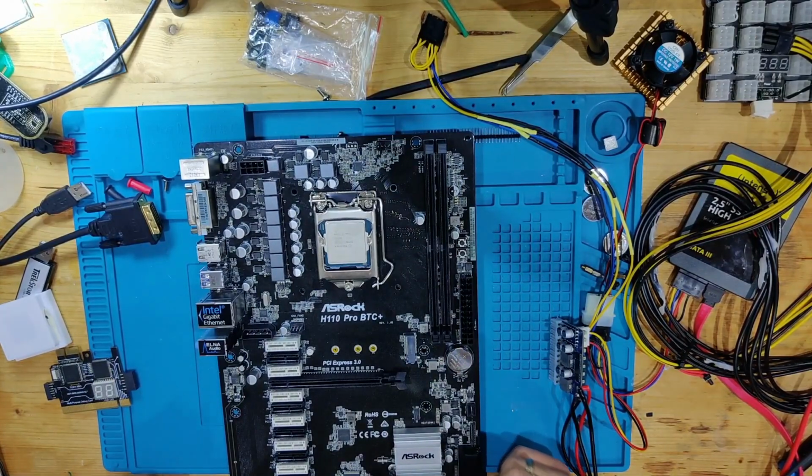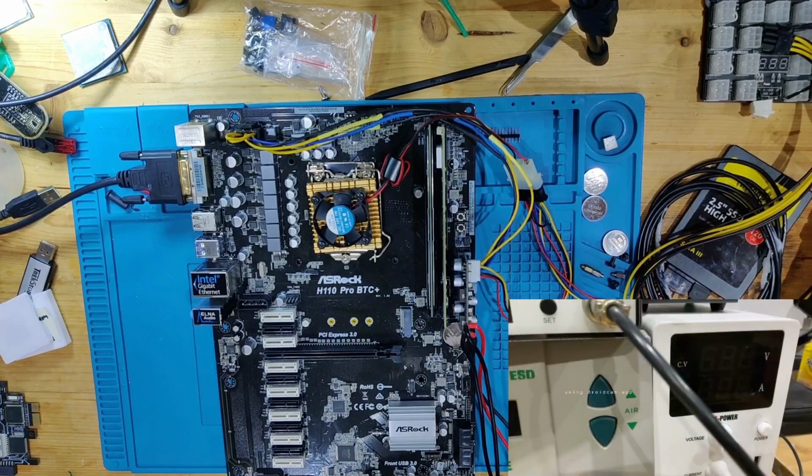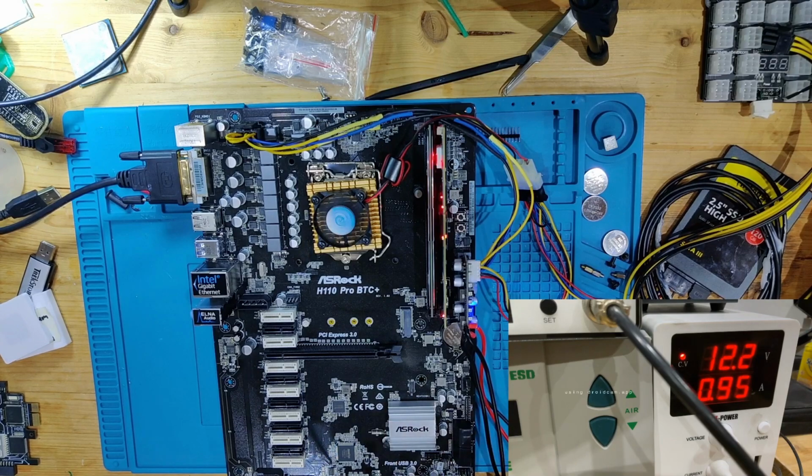Let's get a stick of RAM into here. So we have everything built up. This might be one of the worst things I had so far to do on this channel, but let's see if it blows up in flames. Going to get our power supply onto here, and let's see. Yep, that's pretty bad. That is 500 milliamps of consumption. It actually starts up. This is very weird because we also have postcodes running and the power consumption doesn't look as bad.